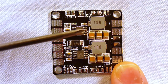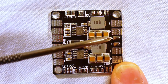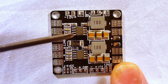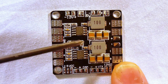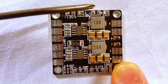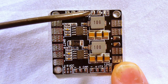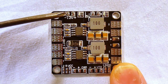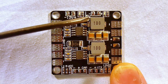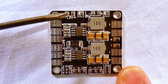If you need battery voltage out for any reason, like battery monitoring, these two pads right here — plus and minus — will give you battery voltage out. You have two switching BECs, one for five volts and one for 12 volts. Right up here is a five volt output, which you might want to use for your flight controller and receiver. Over here is your 12 volt output — these are just straight outputs, no switches.